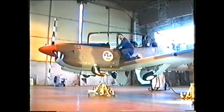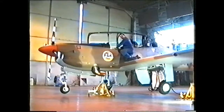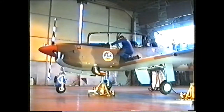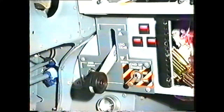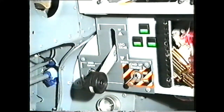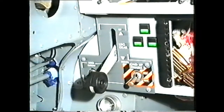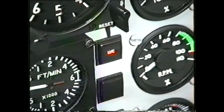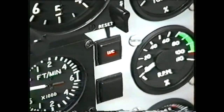When standby down is selected, the doors and the gear legs move together, and the doors will remain open. A microswitch on the standby down selector lever bypasses the doors microswitches to provide normal indication of three greens and the flashing undercarriage indicator out, even though the doors remain open.